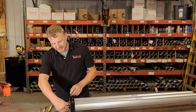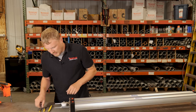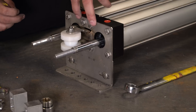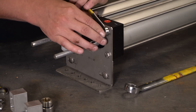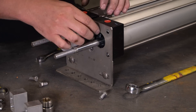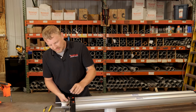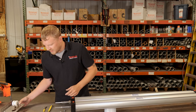To get to the pistons, we're going to have to dig in a little further, so we'll take this back off. We're going to need to take a half-inch wrench and take these plates off here so we can get this top cap off. Now that I have this top plate disconnected, I'm just going to pull it off here and set it off to the side.